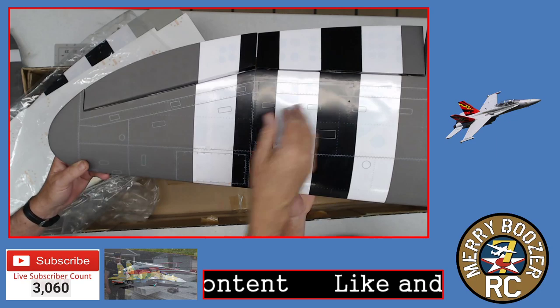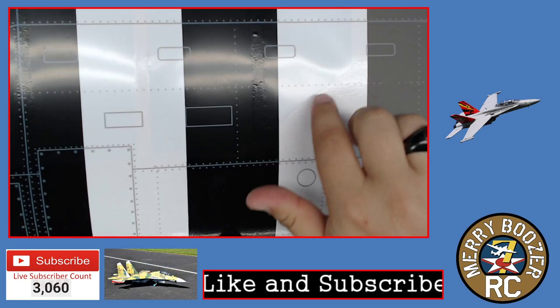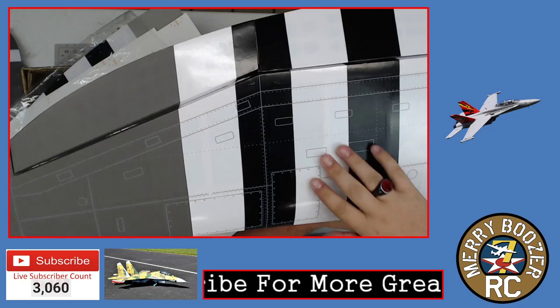Let me see if I can get it up here and show, because with the light hitting them just right, you can actually see it. See the spars? See it? So the spar is right across here, but this part is hollow. And what that does is make this lighter. Light is the key to making an airplane fly good, if you can build it light. There's a spar right there. Hollow, spar, hollow, spar. So that's how they make this light.